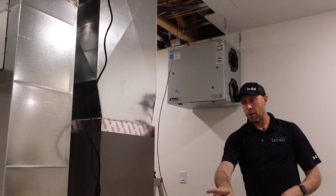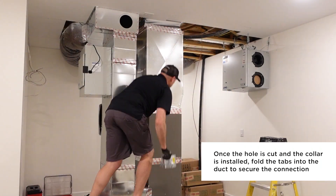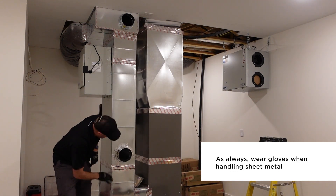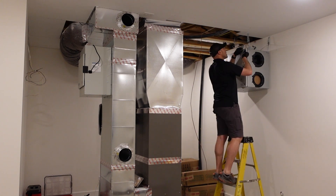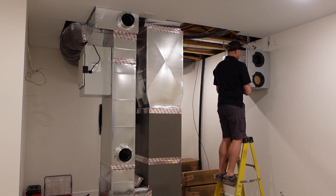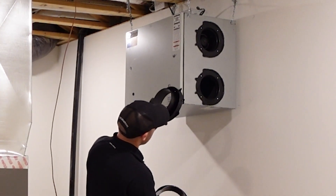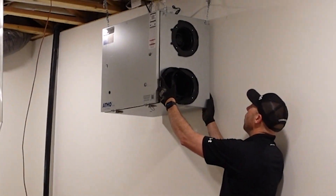Our discharge from the fresh air appliance goes into the return, and then off the opposite side we'll be going to the exterior — picking up that fresh air as well as exhausting the stale air from the system. Because this is our stale air removal, we want to check our guidelines: stale air from home right here, and fresh air to home out of the bottom. We're going to bring both up across the ceiling and then back down on the side of the unit. There are some plastic collars that allow us to make up these connections.